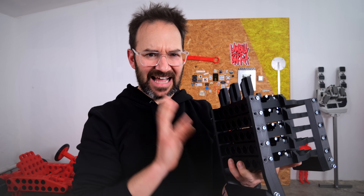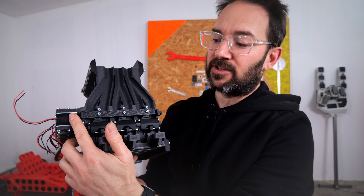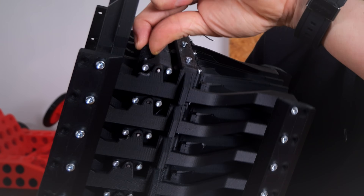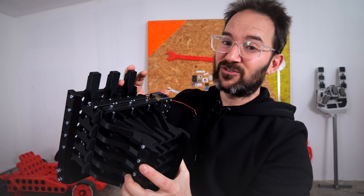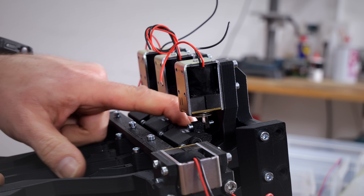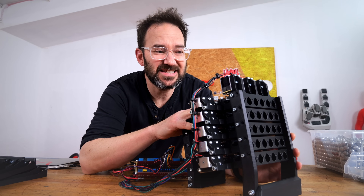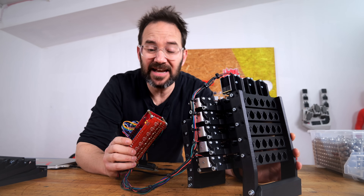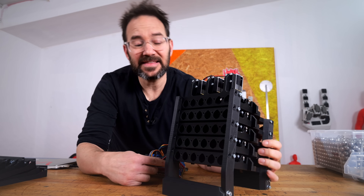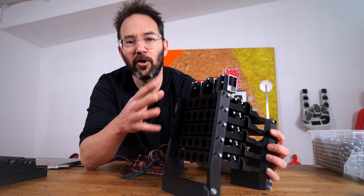This is starting to look a lot like actual clock making. When I assembled each of the five plates, the selection gates are all connected and activated by a solenoid. During the vertical assembly, all the release gates are connected in three vertical groups through levers. To make things even more complicated, I added three solenoids to move them. Those were the last three solenoids, and I wired everything to 16 relays — two relays for each solenoid because these are latching solenoids, meaning they need the voltage reversed to switch positions. I also added some ramps as a buffer since I don't yet have the marble selection mechanism.